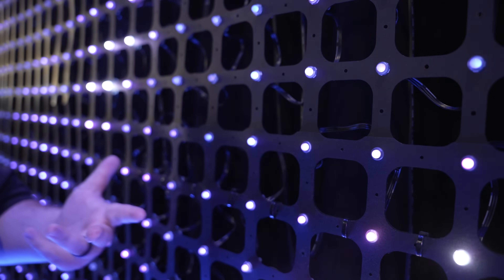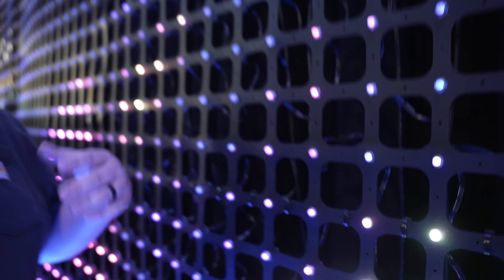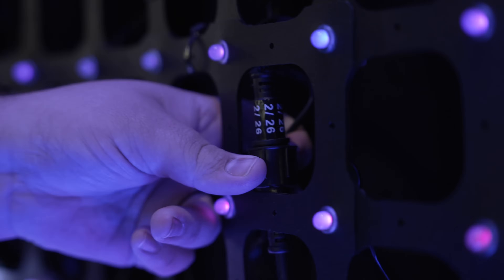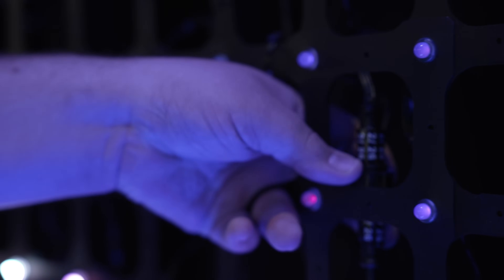The lights came in strings of 100. As I said, this was 11,540 LEDs, and me and a group of our residents placed each of these by hand. It took us about three months. Each cable has a label that corresponds to which Art-net node it goes to and the string of lights. The only way I was able to keep this all organized is a massive spreadsheet that tells me cable name, its subnet in Lumaverse and Resolume, as well as its DMX address and universe number for all the pixel mapping.